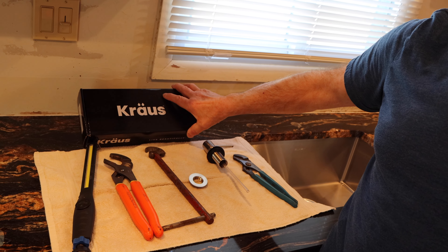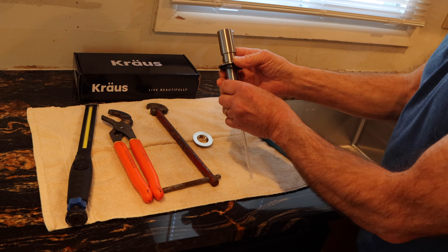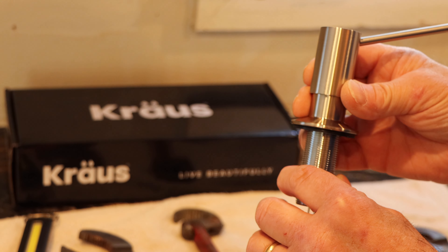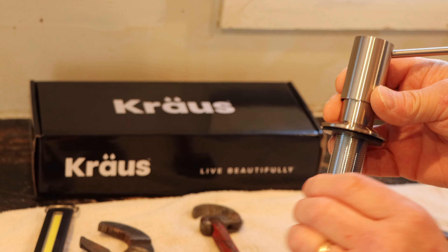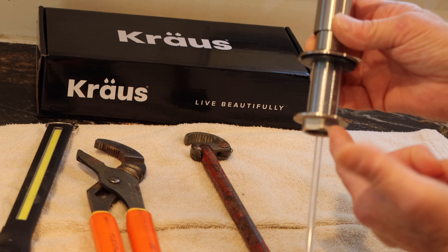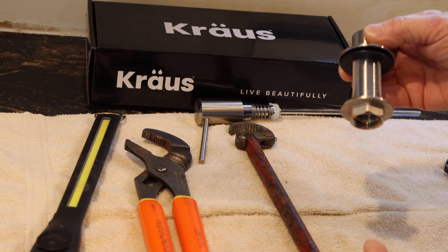This just happens to be the brand that I picked up, but use your personal preference or whatever you prefer. It's very easy to install. This is our new replacement. We have a seal like this, and this seal has got to be on top of the counter itself so that water doesn't get down underneath the countertop and drip inside your cabinet. This is the nut that's going to be screwing onto the bottom. We'll screw it up like that and then tighten it up. We're going to take this piece out for now to make it a little bit easier to work on so it doesn't stick down through here.